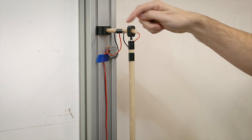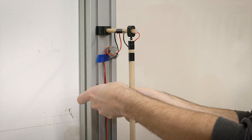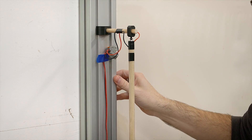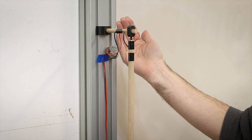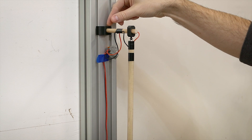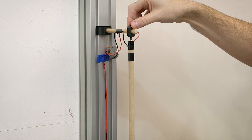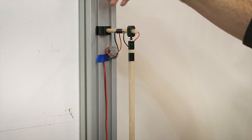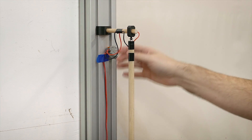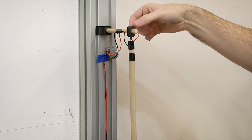The original design was just a single fixed piece that would clip into the rail. But what I learned was that walls are not level — this wall kind of leans forward a little bit, which means that at the bottom, the striker is in the wrong spot. So I had to make this adjustable with this dowel. It simply slides in and out and there's a little set screw at the top where you can dial it in. A key lesson from prototyping: you have to assume the spine or wall won't be perfectly level, so you need some adjustment. The top moves nice and freely and has the wires.